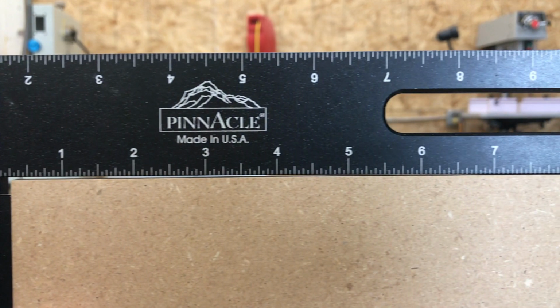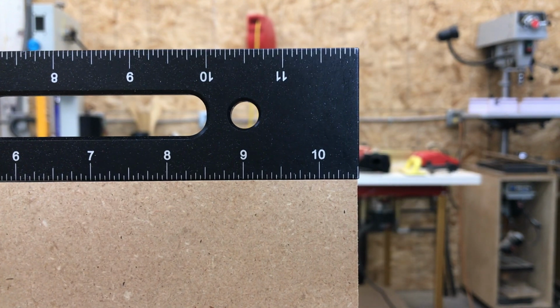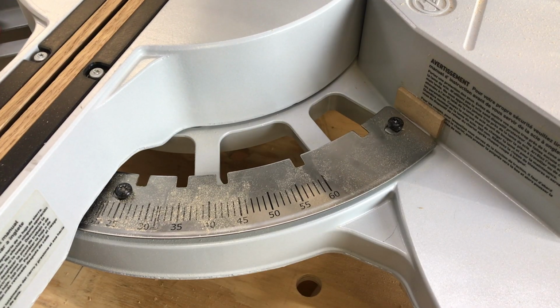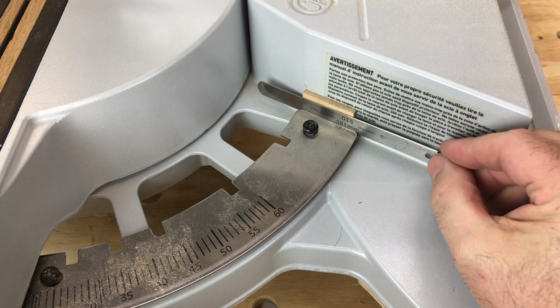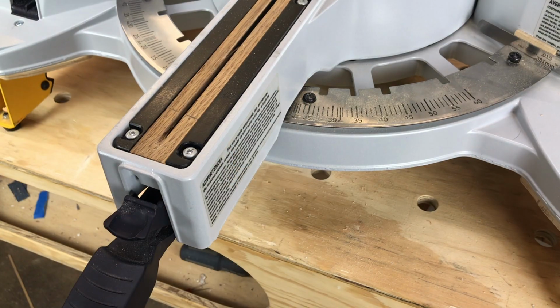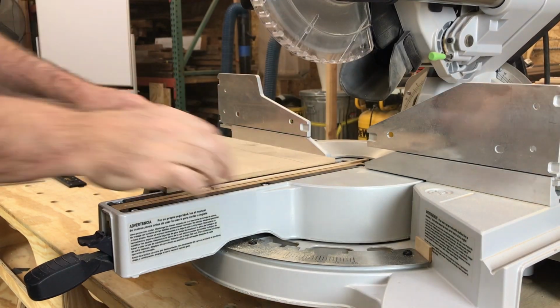Check your results. Identify what direction the saw needs to move and pick your shims. Loosen the plate screws, keeping the saw in the 90-degree detent. Place the shims between the block and plate. While maintaining pressure, secure the middle screw. Cut another test piece and check it.